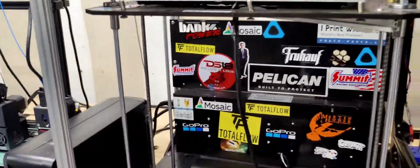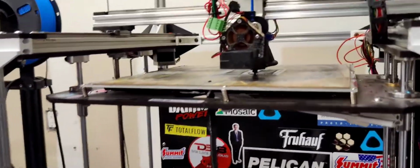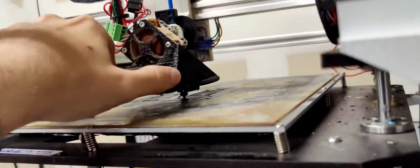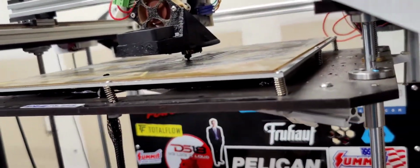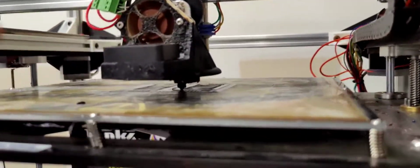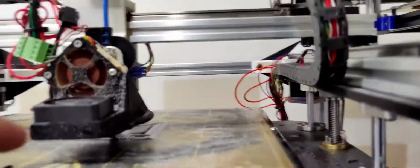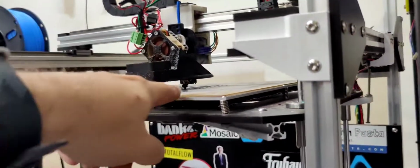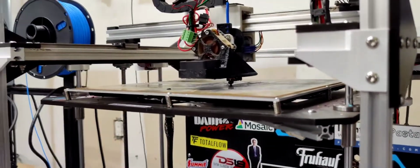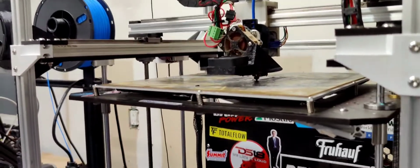Okay, so this is a problem that some of you might run into, as a general daily update. You see this? I have a J-style nozzle. Anybody that gets into customizing their printer and doing changes, if you add a J-style nozzle, and I've got this style part cooler, this style part cooler is a bit higher than the nozzle. Ideally, you would want this part cooler at about the nozzle height. I like this for clearance sake. If you ever get anything peeling, you're really not going to tear that up.